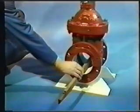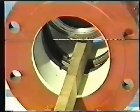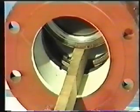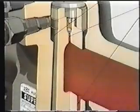Also, because most valves are subject to sticking, the actuator must be capable of recognizing that this has happened and so switch itself off, even though it has not reached the limit of its travel. This plug valve, for example, may lack lubrication, and extra force would only damage sealing surfaces.